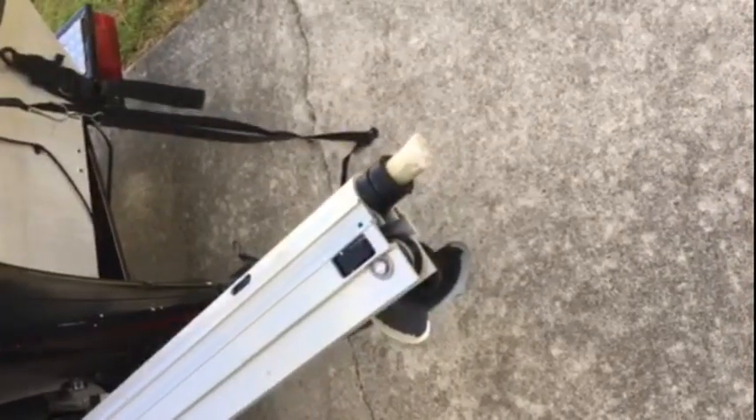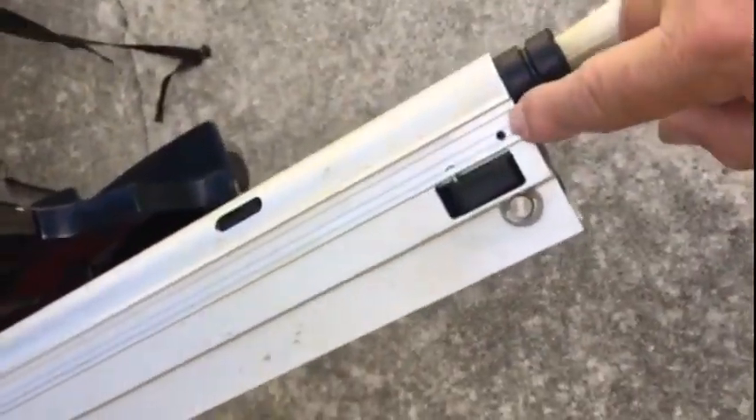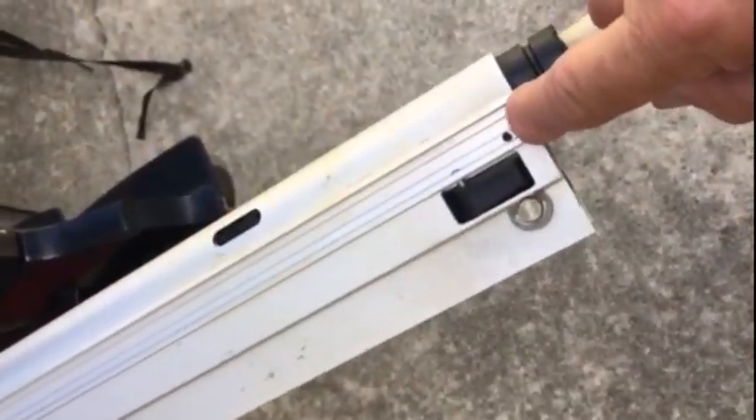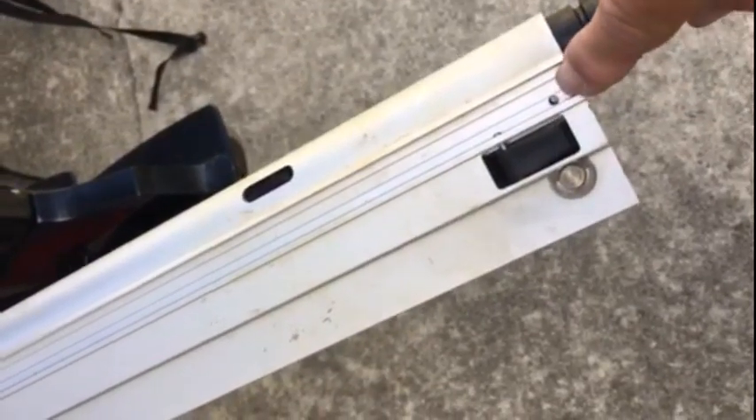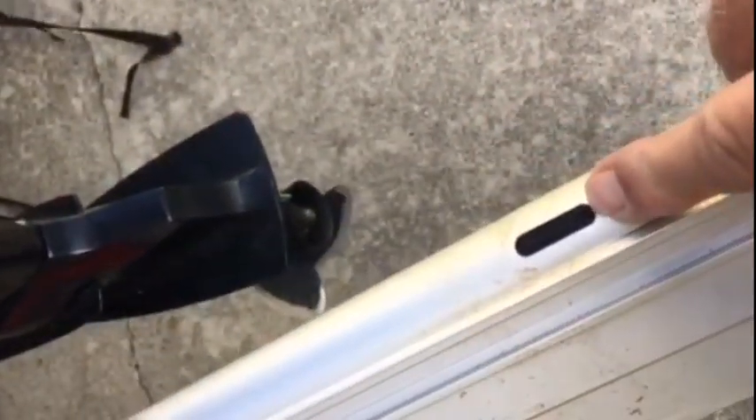We're here to replace a talon that broke off the spike. What we had to do was pull the pin out — we tapped it out with a drill bit. There was also a pipe piece of the spike in there, and we had to pop that out with the drill bit as well.